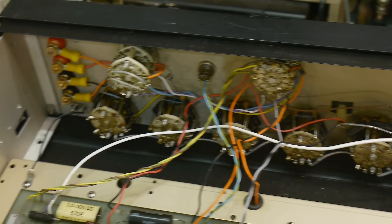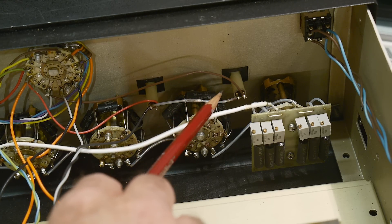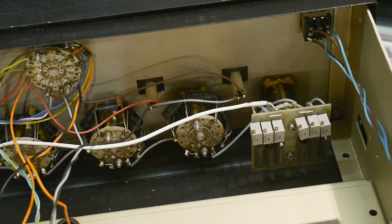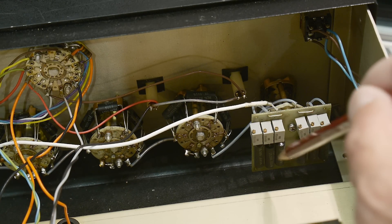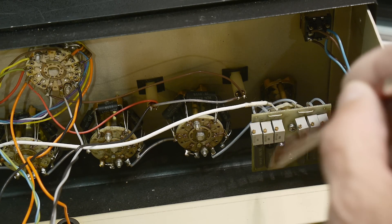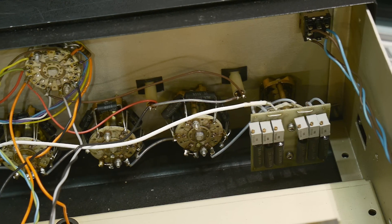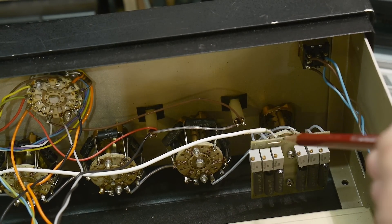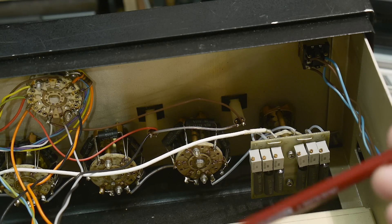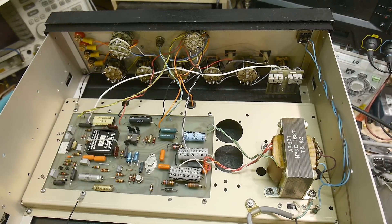Where the money is spent in these instruments is in all of these resistors. This one I can just read: it's 2K at 0.005% — very expensive resistors. The calibration for the switches and different values is done here with six adjustments. Once you get the high end working on the volts range, everything else is a reduction via a voltage divider from there. Because these resistors are 0.005%, it stays pretty accurate once the high end is calibrated. I believe the 106 manual has a section on calibrating these things, so I should be able to use that to get it up to snuff.